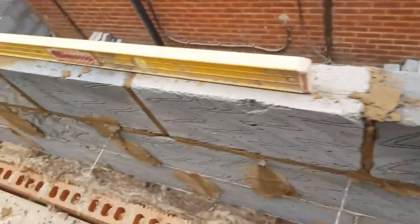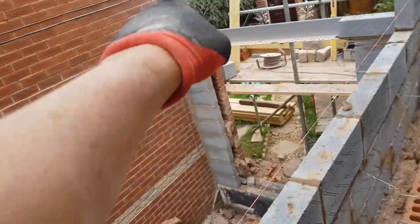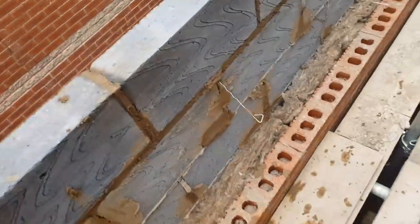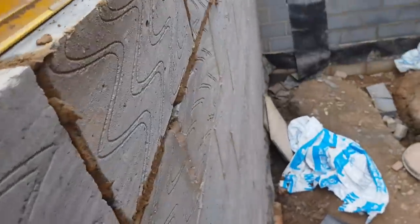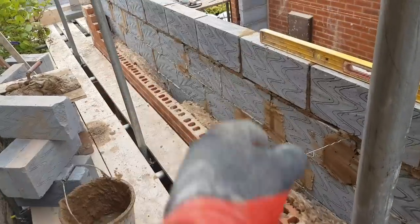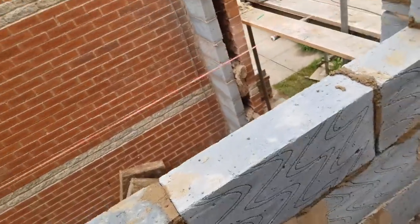So that first course is on and the six-foot level is saying spot on, so I'm buzzing about that. Just put the joist from my block — what I've laid there to there — perfectly level. Just a quick note: I've pulled this line super tight. I laid this course from down there and I could barely get my line tight because I was reaching over, but I've pulled this really tight. It's a good job I have because I've pulled out a load of sag that was in the line previously — I've probably got about a 15mm bed down there. If you don't pull your line tight enough, even though it's been running with a line, there will be a little dip in it. So just a little note — always pull your line as tight as possible.